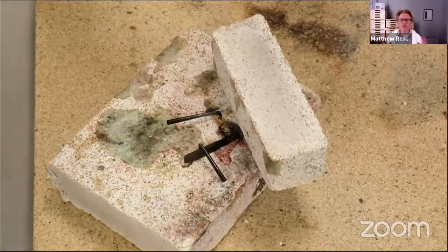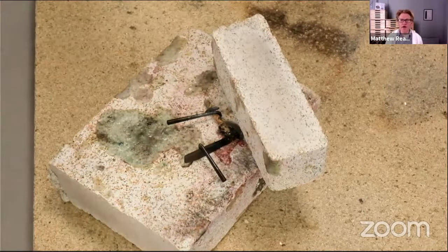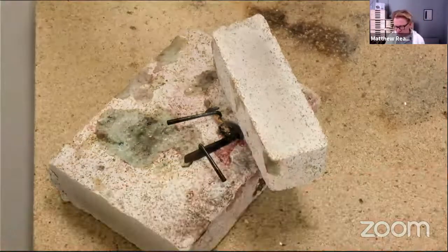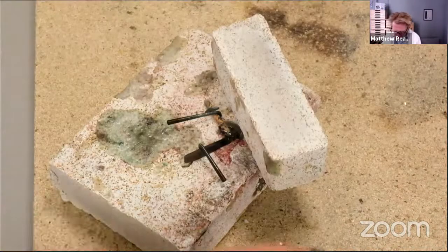This silver soldering, if you've not done it, get some solder. I say this every time and just practice, because if you get the thing clean, flux on, temperature right, put the solder on, it flows beautifully, it's really strong and it's really satisfying. If you don't do that and you're not practiced when you come to repair something, it will go wrong and it's really frustrating. We soldered on our extension on our arbor here and you can see how incredibly neat it turned out. Anyway, let's have a look.